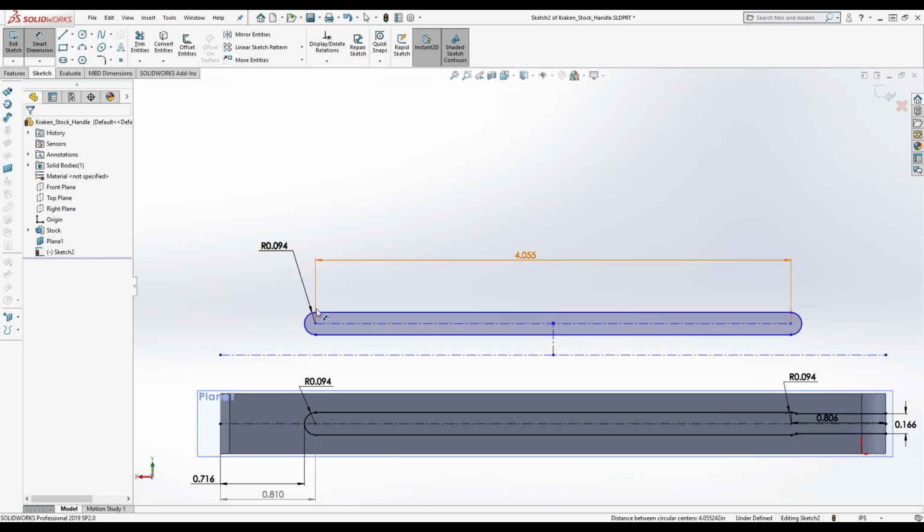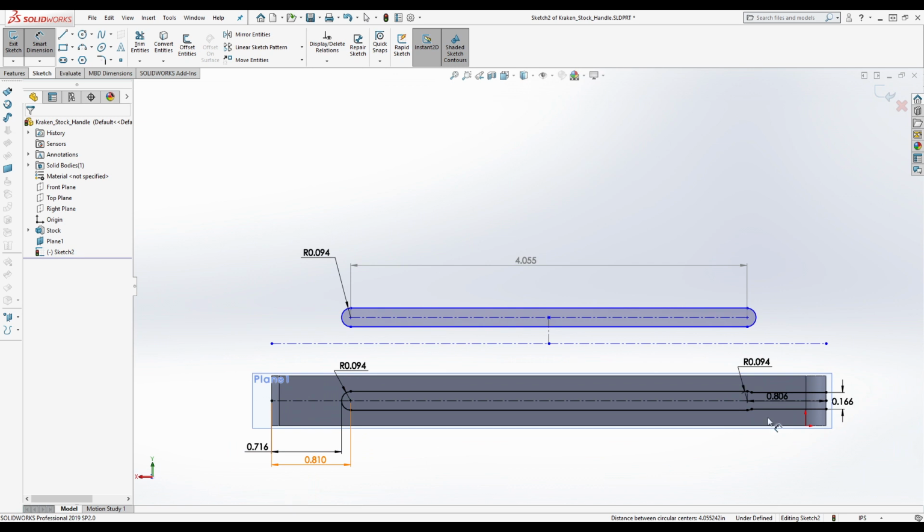And this to me seems about right because 0.810 and 0.806 are very, very close. That's 2/1000 away from being centered, 2/1000 of an inch, right? And it's also not a very round number, right? Even if you're considering measuring from the sidewalls versus measuring from the center, it makes a lot more sense that he would say this distance here is 4.25 inches, and then he centers it, right? So that's my guess, okay?